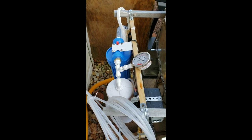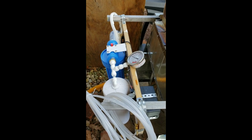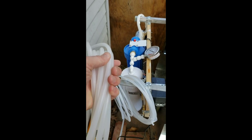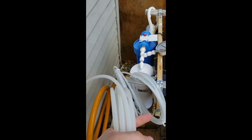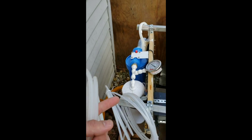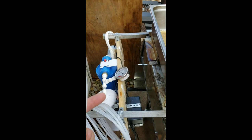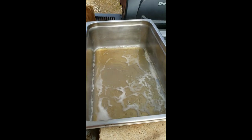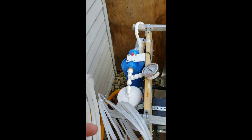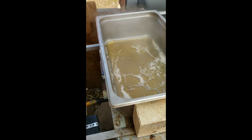We've got our RO set up on our evaporator — it's just mounted here for ease and keeps all the components in a vertical orientation. Today we're going to cover use of this machine: the inlet and exit from both a permeate and concentrate standpoint, and adjustment of the needle valve to make sure your flow outputs are balanced. This area on the evaporator is also where we stage a steam pan to draw off from our main boiling pan, sized appropriately to do finish boiling. We've got some syrup up here finishing while we start concentrating sap, then we'll put that in the main evaporator pan and boil it down in small batches into our finishing pan.